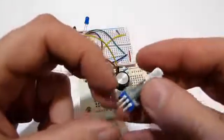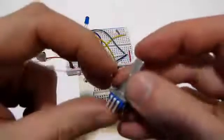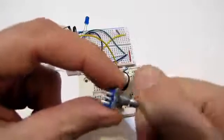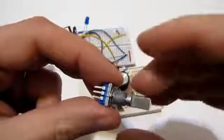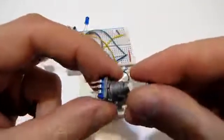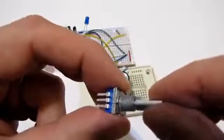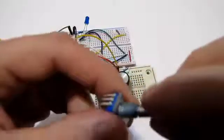The usual way to attenuate that is to add capacitors on both outputs. And that works if you turn it at a normal rate. However, if you test it with a logic analyzer or a scope, you'll know that the duration of bounces when you turn this extremely slowly is actually longer than the duration of legitimate signals when you turn this really fast.